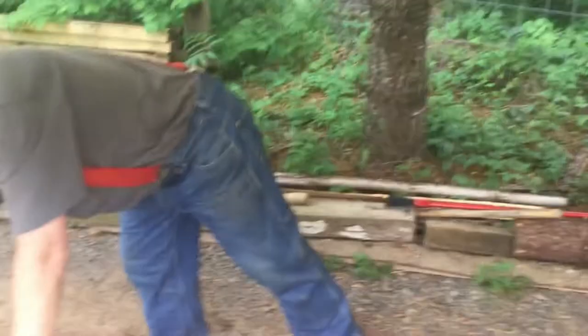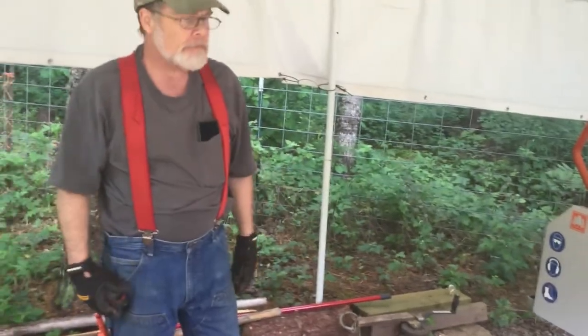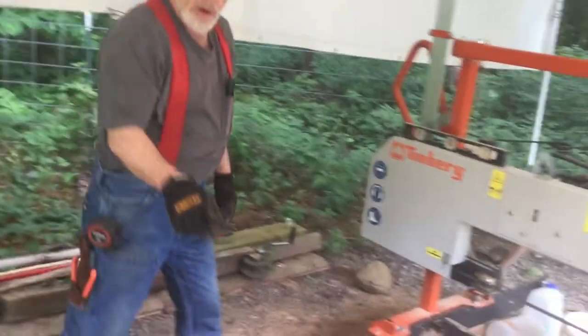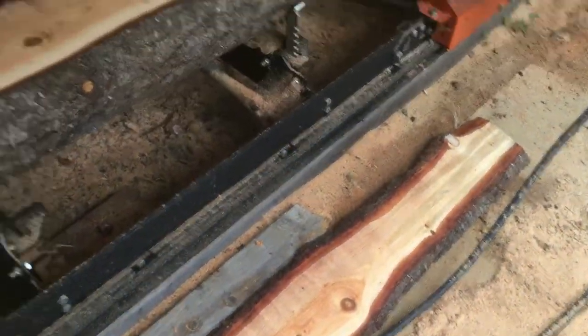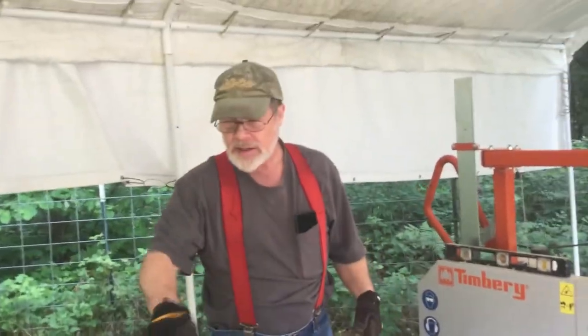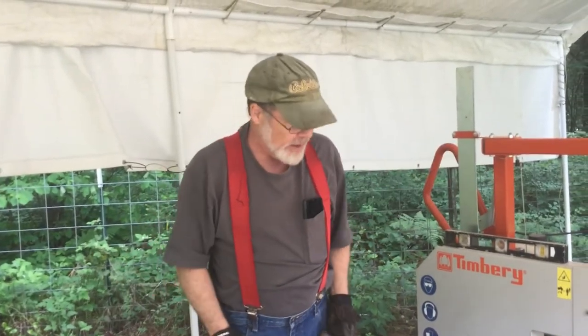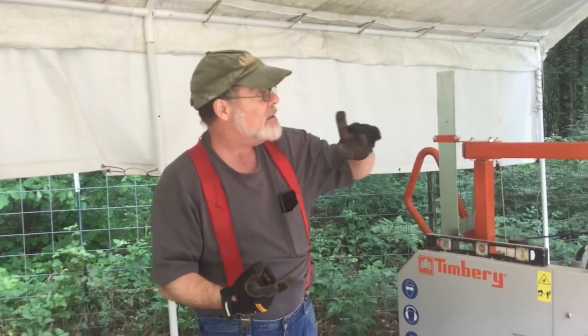So a quick question while you work. How long does it take to season these boards, and how do you do that? What I'll do with the one that's on the ground at your feet and the subsequent ones that I take off is, once they're cut to the width that I want, usually by taking off the bark, or you could leave the bark on for a live edge effect if you wish, I either move them over to my greenhouse, which we can film in a few minutes, or I stack in the open.